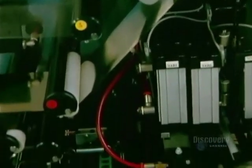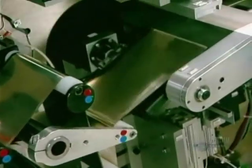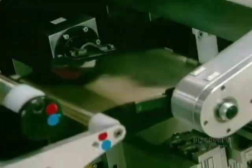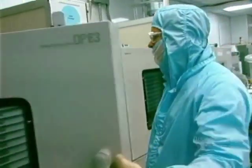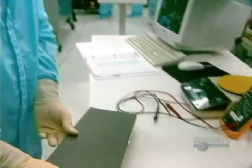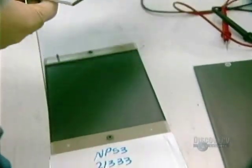The sheet will be used to make individual battery cells. These cells will be assembled in series and in parallel and inserted into modules of different shapes. To make an individual battery cell, the sheet has to be rolled up. This automated spooling machine winds up the lithium film in 26 revolutions. The wound up sheet is put into a vacuum oven where the various layers adhere firmly to one another. This step lasts for about 90 minutes at 80 degrees centigrade.